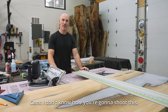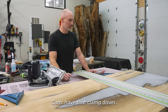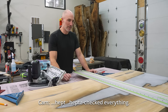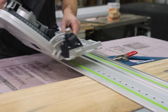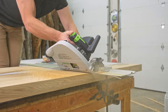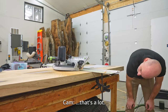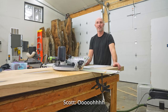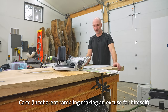I'm literally going to crawl up here to make the cut because I'm not long enough to reach over. We've double-checked all the measurements and angles. The cutting depth at 45 degrees is two and an eighth inches — this is two and an eighth — but that doesn't include the track. I'd like to pretend I didn't know that, but I did. I thought it looked deep enough when I held it down there.